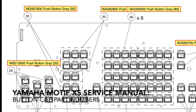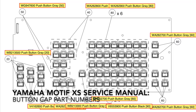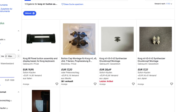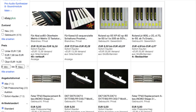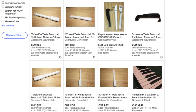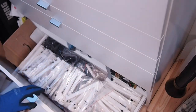To get replacement buttons for current synths is easy — just contact your local synth dealer who can order them directly from the supplier. Make sure to provide a good description or even better the part number from the service manual. For older synths it's harder — you really have to search on eBay or just buy a donor synth to use the button caps from. Replacement keys is much easier; there's enough supply of new and used keys on eBay for old and current synths. I personally keep a stock of synth keys, primarily Yamaha keys like for the FS keybed as used in the DX7, but also the Korg M1, and of course some piano keys for the GH keybed.